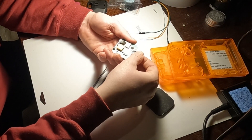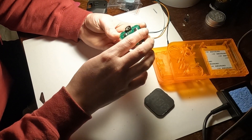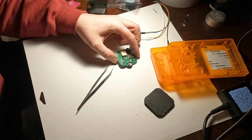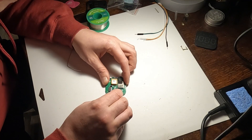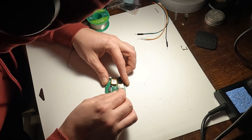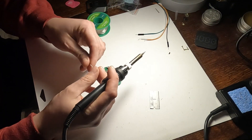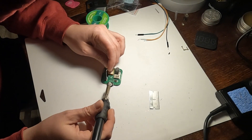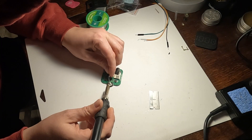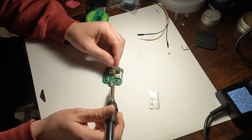With some really fine tweezers, I'm pulling the metal bracket off the back of the button assembly on the back of the GPS unit. Then all you've got to do is pull that little black piece off — it's a spring loaded thing. And then there are four little contacts. The way that this controller works is there's a ground, and then there are three different spots used for completing the circuit for either down, left, and right. There's some plastic that surrounds the edges of them, and with a razor blade I just gently remove that plastic off the edges. Then I'm putting a little bit of solder into those contact points so that when I go to do the wiring, I can just heat that stuff up, lay the wiring into it, and it'll be way easier.